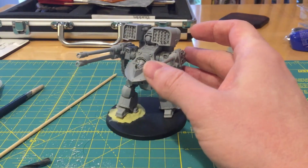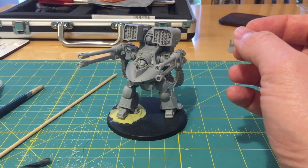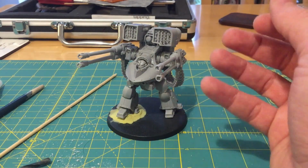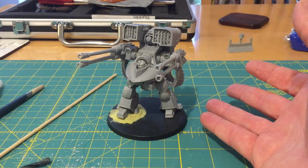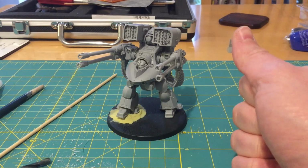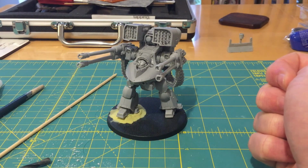Now, the reason that was happening, and why I would very, very strongly recommend not to take that approach, is that if you heat a magnet, or a magnetic material, past what's called the Curie point, the magnetization will start to be lost and will very quickly be completely lost. So definitely don't heat a magnet up and then squish it into plastic as a method of recessing it, because you may well cause a loss of magnetic strength through crossing that Curie point.